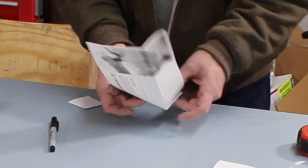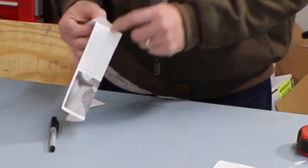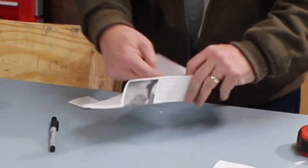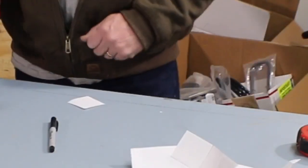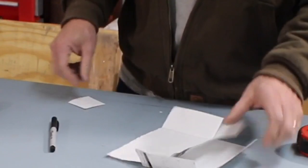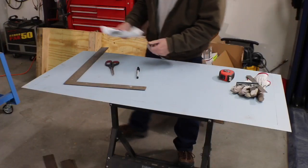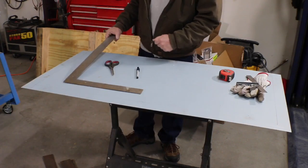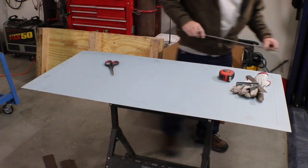But now, all you have to do is weld over here, or spot weld it, or you could tack weld it here and tack weld it over here. It gives you a couple more places, and you don't have to put quite as much heat into that sheet metal. So my plan is to bend them with the tab on them, and then we'll weld them together.